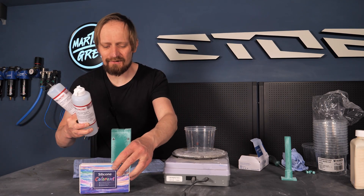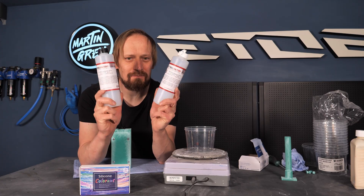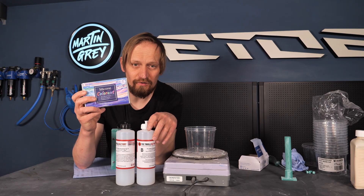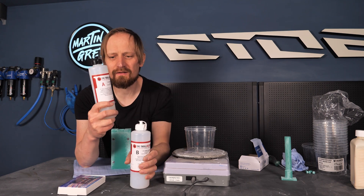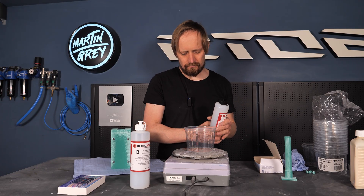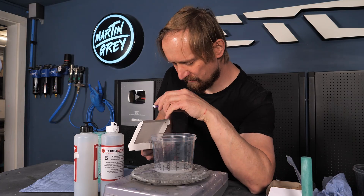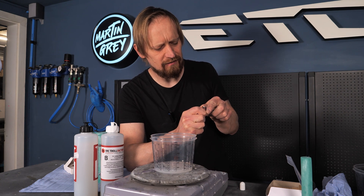The moment of truth, folks — my first silicone cast! What I'm using is a two-component silicone shore 32, so medium hard, and it's easy to use because the mixing ratio is one to one. I'm using a scale so I know exactly how much silicone is added, and I'll also use some color — I found this on Amazon, link in the video description. It's called component A and component B. The amount I need is exactly 60 grams, so 30 of each. Let's put it in. Then let's add the color — I like to go with purple. There are eight different colors in this box, but I have a purple BMX and I'll put these grips on it. Purple BMX, purple color, purple grips.